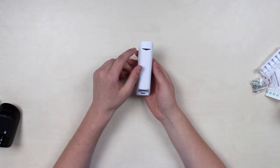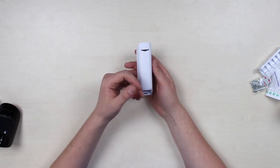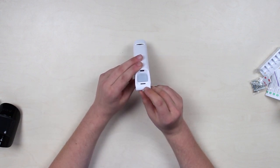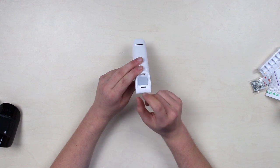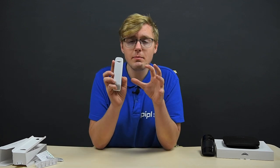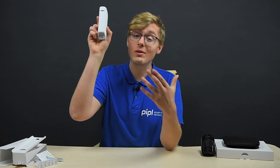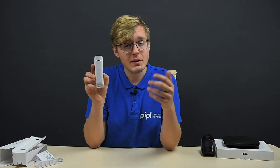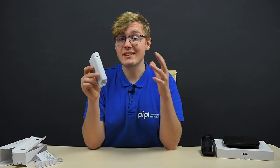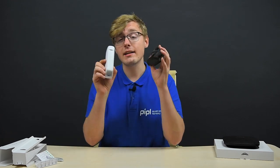The device has an LED indicator on the front panel's upper section in the Ajax-specific shape. The main element we care about is located on the bottom behind this Fresnel lens inside an inclined cutout. The purpose of this design is to make you hang the sensor as high as possible, right below a ceiling or at a doorway top, to create the appropriate angle for the sensor to observe a site. This is what makes the difference between a curtain and a Motion Protect.